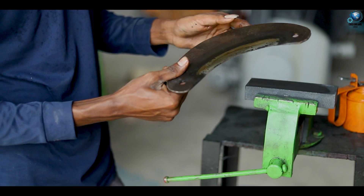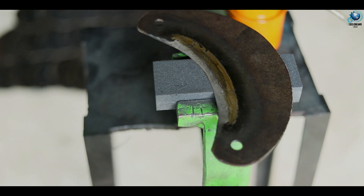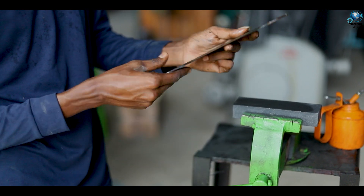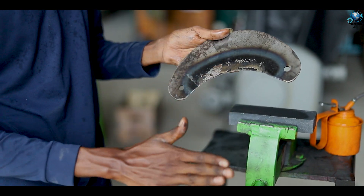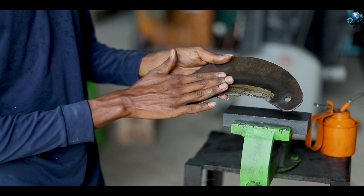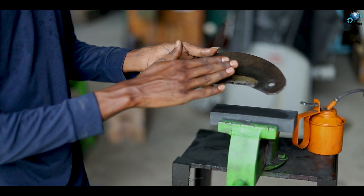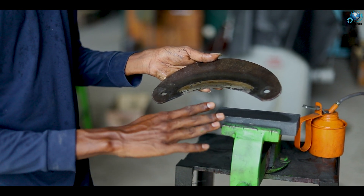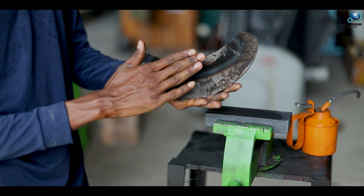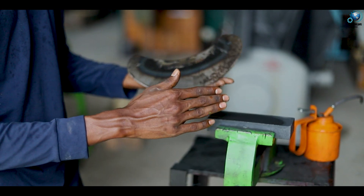You can see there are two sides on the blade. The first side is very slope — this one is the cutting edge. The cutting edge is very slope. The other side is very flat — there is no slope on this side. You should always sharpen this slope side. But we will sharpen this flat side only very briefly — I will let you know when I am sharpening this blade.